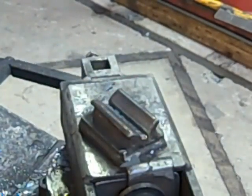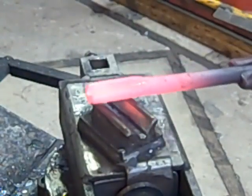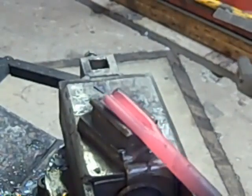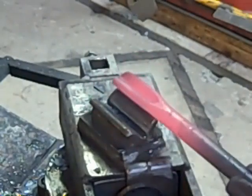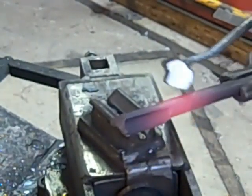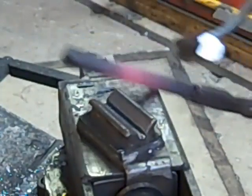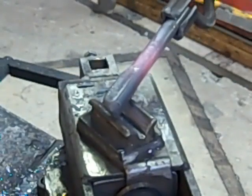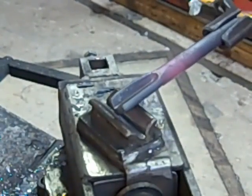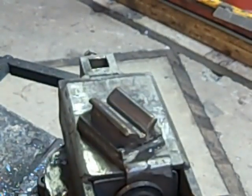We're going to take another heat and we'll do it again. It's fairly even, a little bit heavy to the left side, so we'll correct for that by turning this just slightly. It's looking pretty good. We're almost there, a little bit more. That's pretty much what we're looking for right there — we can drive that in even deeper. That's probably adequate — a fair amount of material there. I'll give it one more heat and sink it in pretty deep this time.